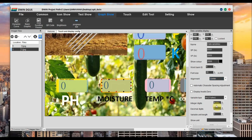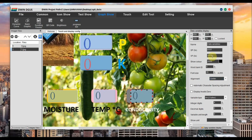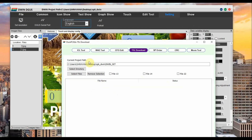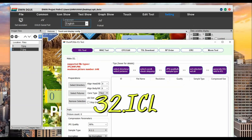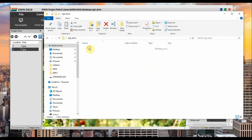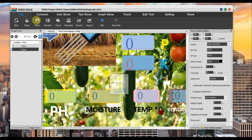At the bottom we have the other four values: pH at VP address 0x2040, moisture at 0x2050, temperature at 0x2060, and conductivity at 0x2070. According to these VP addresses, we will send the data to the DWIN display for displaying the values correctly. pH, soil moisture, and temperature are displayed as floats. Since DWIN can handle only integers, we use the decimal settings to display float values. The images should be converted to ICL format and stored as 32.icl.